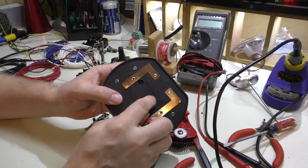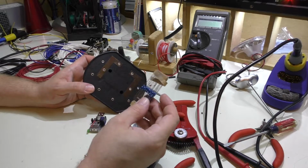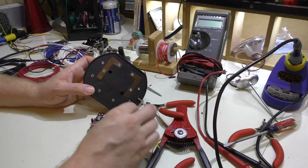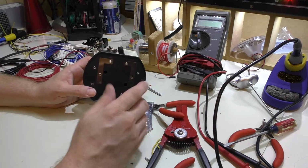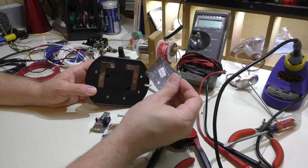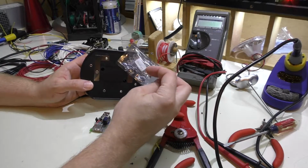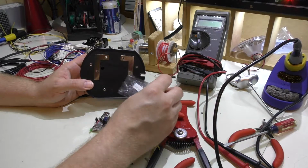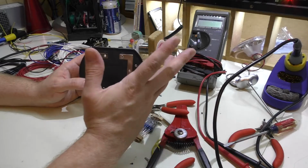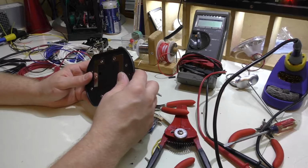I'm thinking about putting in here so it comes out the front. I also have some LEDs and some resistors. These are 510 ohm resistors, and these are orange LEDs. I'm using 510 because I just have a list of resistors with 5 volt and 12 volt inputs, and each LED color, with the appropriate resistor for those 2 different voltages, because that's what I use the most, and I use the calculator to figure that out, an actual LED calculator.